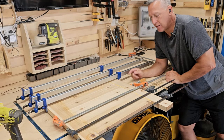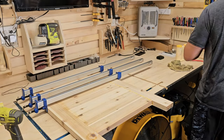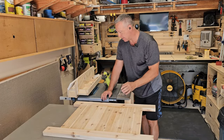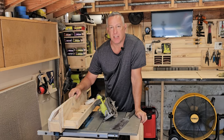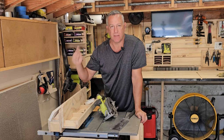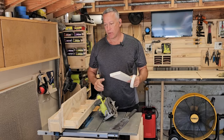I've given the glue some time to dry and I've already put in the screws in the pocket holes at the bottom. So I'm going to take the clamps off and clean up the glue — it still has to continue to dry, but at least I can clean it up and get the glue off before it completely dries. I'm ready to cut off the edges of the board now to make it all squared up. You can do this in a couple of different ways — you could use a hand saw, a circular saw, or what I'm doing is using my tapering jig or my L-fence jig. I'll leave the video link up here to show you how I made this. This will make quick, easy, nice and straight cuts — all you need is some double-sided tape and a straight board to trim off the edge and make it nice and flush.